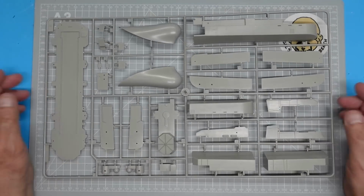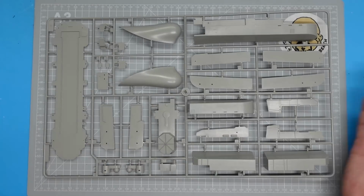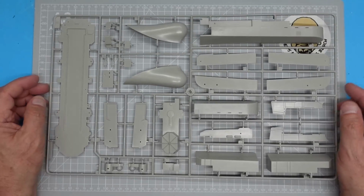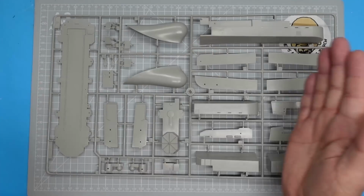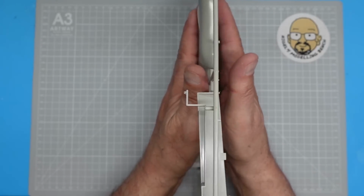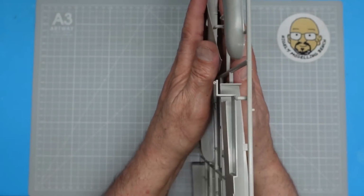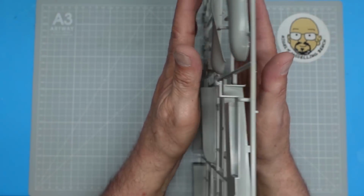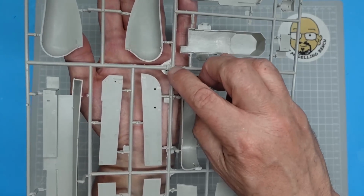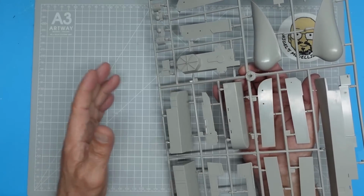And what you have is 2 mold tools. Well, 1 mold tool, it's called 1 mold tool, but you have 2 halves. Sometimes you have 3 or 4, 5 sections to a mold tool. But in this one, I think it's just a 2-half simple mold tool. And it comes together, the tool comes together, the plastic is injected, so you've got the sprue is like this. Generally machines are horizontal, so they do actually activate like this, left to right, rather than vertical. Some machines are vertical. And then what happens is that the halves of the tool come together, plastic is injected, and it's injected through this center area here, and it runs out, and it fills all the little chambers and everything.